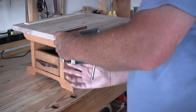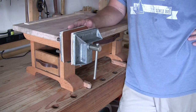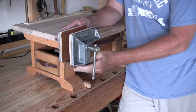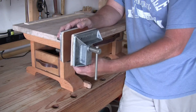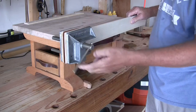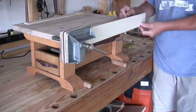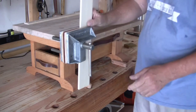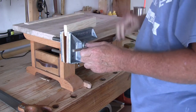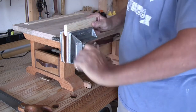This is the Stanley 80-702. What's great about this little gizmo is it's very handy and lightweight — it's made of aluminum. You can set it up so that this surface here is flush with the bench, and that allows you to put in a piece of wood and have it flush with the bench. You can stick another clamp on here and hold it, and then you're rock solid. Or you can stand one up here and plane. I've always felt like that's not as easy as this.